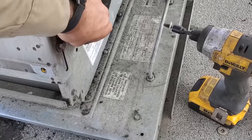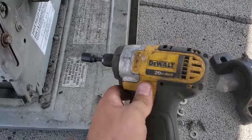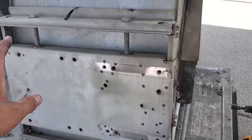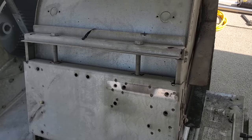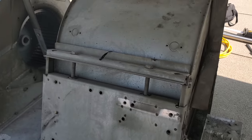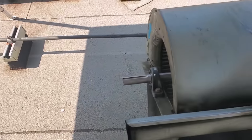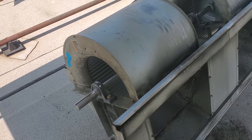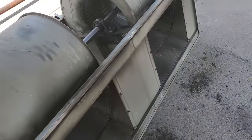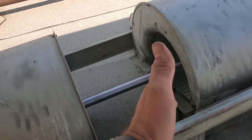As I'm tightening things on, you don't tighten screws down - you just keep them loose. I am using an impact but I've got trigger control. We're leaving everything loose, just threading the screws in, and then once we get everything threaded we'll torque down. But you've got to be cautious because if you just drive one in, nothing else is going to line up. Just a little bit at a time, assembling slowly. Aligning everything works best with two people, but when you don't have two people you just take it slow. Remember not to forget things like putting the locking collar race on - had I done the bearing without it, I would have had to take everything off.